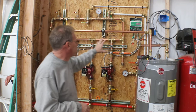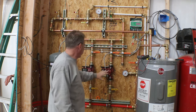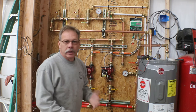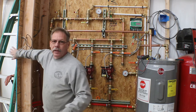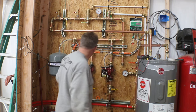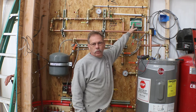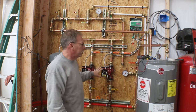What I've got left is, you can see I have some wiring that I just kind of temped together. I don't have the covers on the motors yet because I didn't have the connectors for going into the motors. So I've made a run to electrical supply this morning, got that kind of stuff. I put my thermostat on the back side of this wall right here. But right now I have my first two pumps, which are on one zone. They're wired together, and then they're wired as zone one in my controller. The third pump is actually not even hooked to anything yet, and probably won't be for a while.